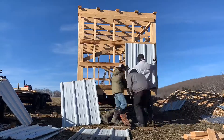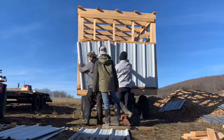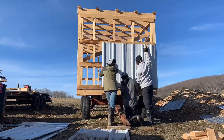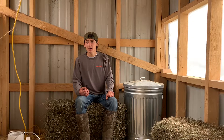Now that the strapping is all done and the tin is all cut, it's time to put the tin on. The tin is really easy to put on — just a bunch of screws, going all around the building. We did the big wall with the door first. The biggest thing we had to figure out was how to do the corners — whether to cap them with 1x6s or use lumber. But someone had the great idea to actually fold the tin around the corner, which made it look amazing — very professional. Folding over was probably the best thing we could have done. It left no gap, just a couple of added screws, and everything fit better when folded over. We didn't even have to cut the tin to width — we just snugged it in and wrapped it around enough to fit.